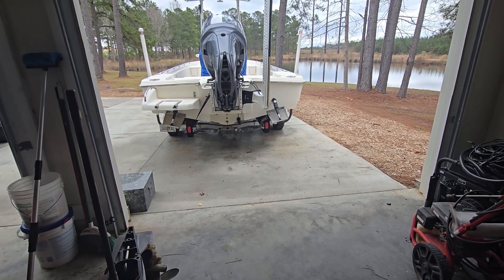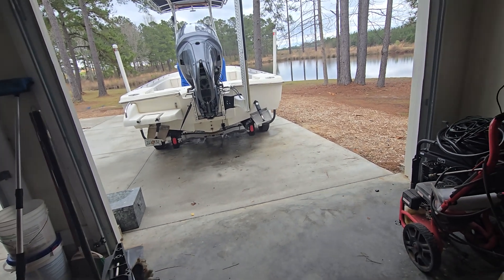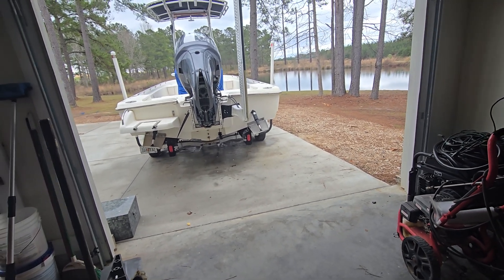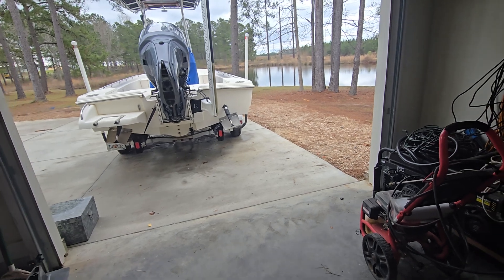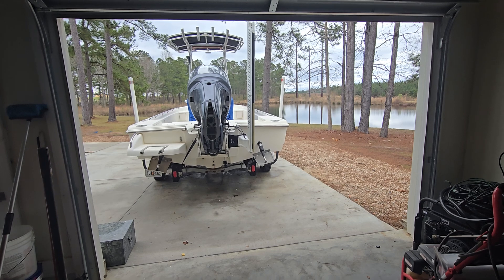Labor-wise, if you're going to pay a shop — if they're going to be in there doing an exhaust, tell them you want a sleeve kit and an oil pump done at the same time. It's about $500 and you're done, versus a couple thousand dollars to go back and do it later with labor tacked on. That's just my advice.